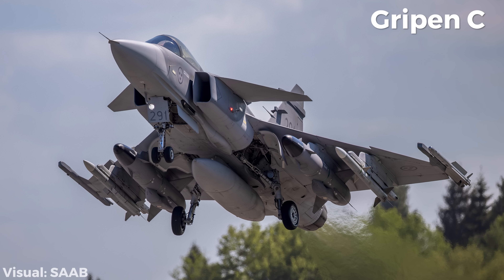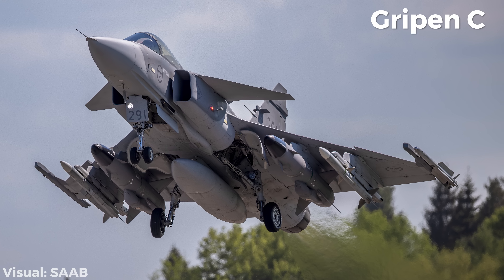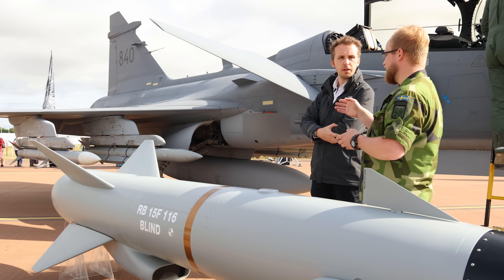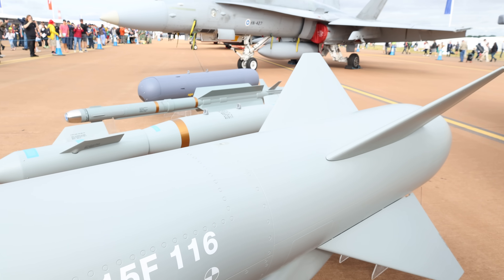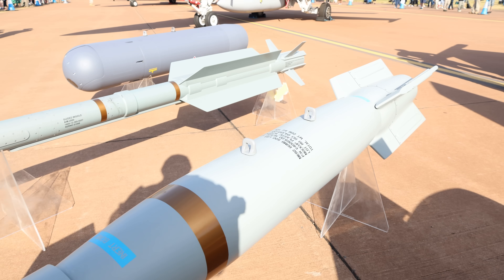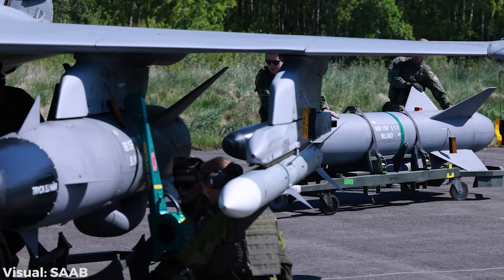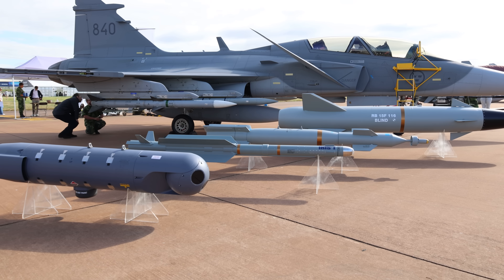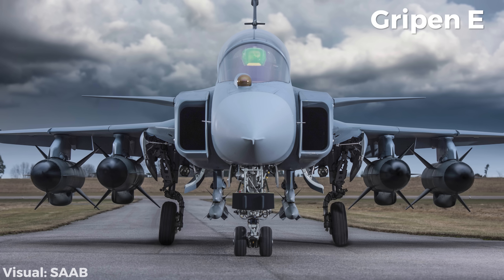That's what this does — it's very mean, it's very big. On the Charlie/Delta version, we can install two of them on the inner pylon where the Meteor is located. We use them on the Swedish pylons, not the NATO pylons, so you just hook it up and it's done — it fits right here. It has a type of hook that fits in the Swedish pylon. It's really easy to install, but it's heavy — you need four winches and four people plus a trolley to install it. And on the Echo version, we can install four of them.